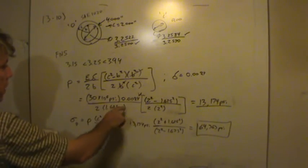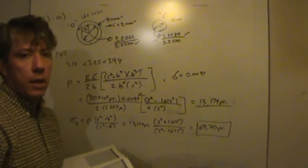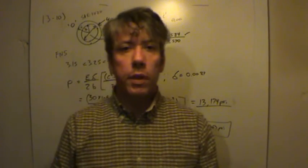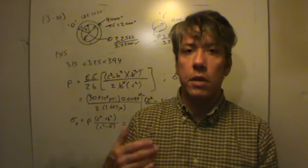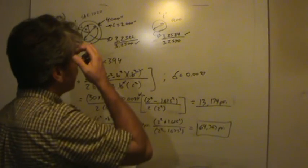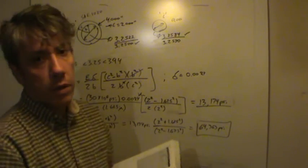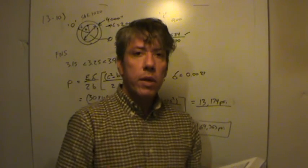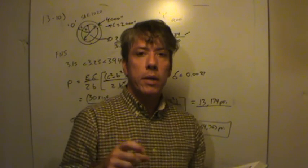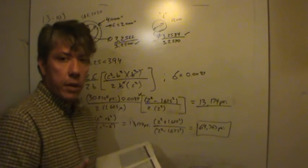Interesting, that's just reversed. So 4.8, and that's going to be about half, and this would come out to about half. So if my approximations are correct, then that would still be above 30,000 psi, and it would still yield, which is not acceptable. But like I said, it is possible that you would have this much interference and it would break. Now, another possibility, notice I chose an FN5. We could decrease that. Maybe a lighter force fit would be acceptable, where it would be guaranteed less interference. If we could get away with it, then that would be fine.